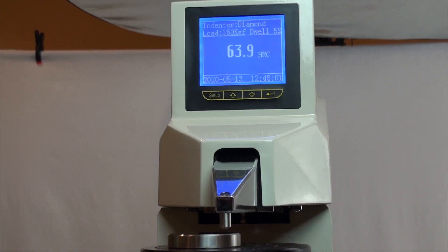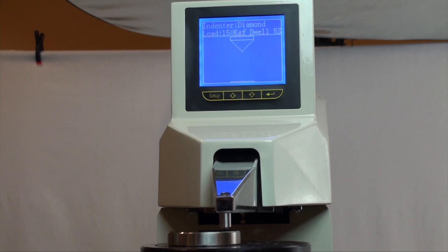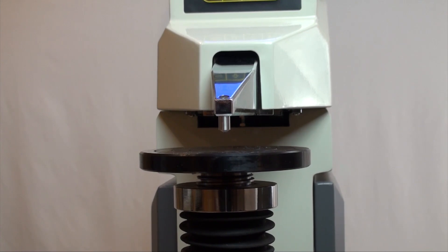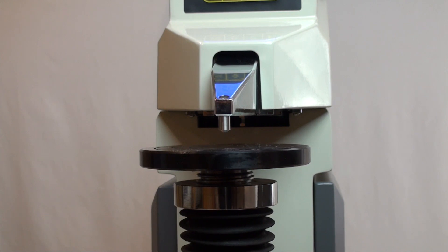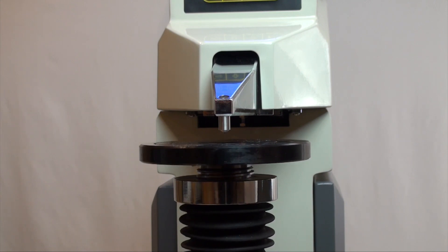Taking a test is as simple as affixing your test block on the anvil and pressing the start button. The machine will automatically take the test and drop about 2mm from the indenter when it's finally finished. The reading will then show on the screen. Taking another test is as simple as moving over the workpiece being tested a small amount and pushing the start button again. Note: the auto Z-axis can move automatically by using the controls on the side. The machine can perform a hardness test from any height position. However, if time is of importance, you may want to consider making sure the test starts from as close a position as possible.